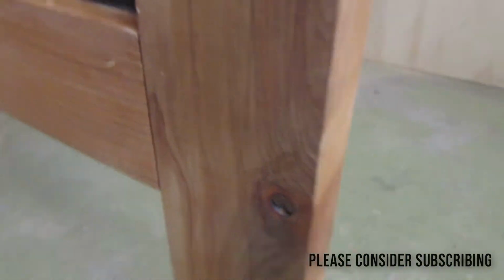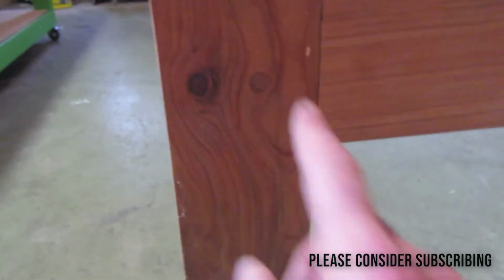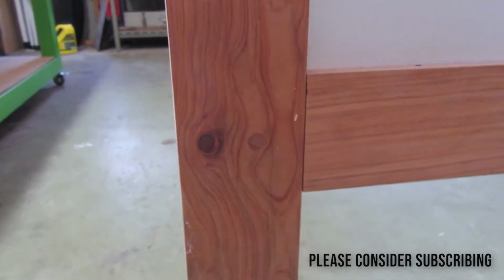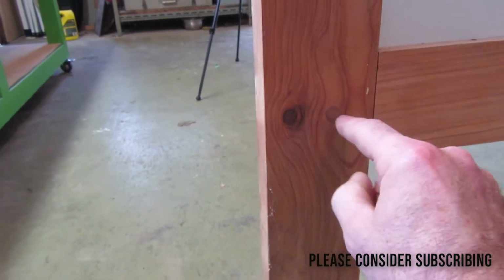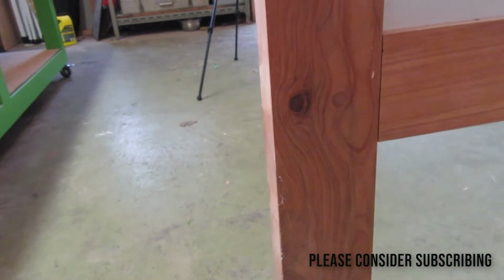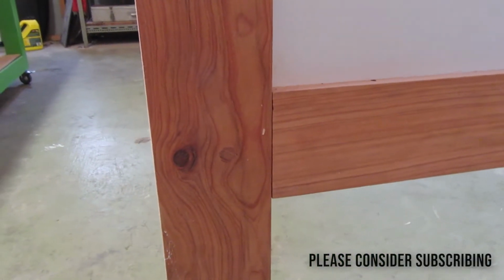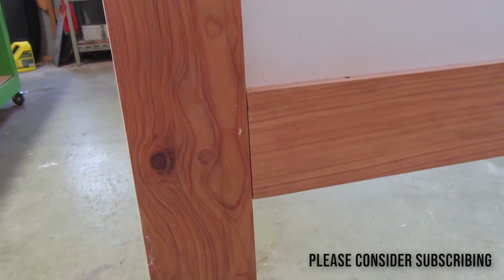So obviously there's no way... So how did you fix that in there, Gary? Well, you can see right there, that's a little plug. That plug goes in and then inside the tenon. So if I need to later down the track, I can drill into this, hook into it, and pop it out, and that whole thing will come apart. Yeah, it's just a housed tenon with a little dowel pushed in there, locking it all together.